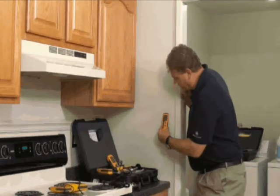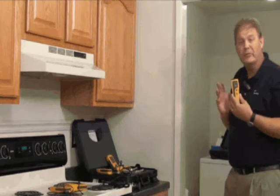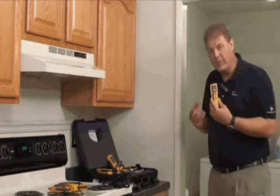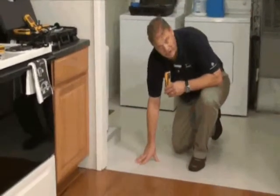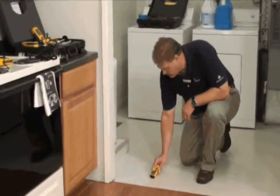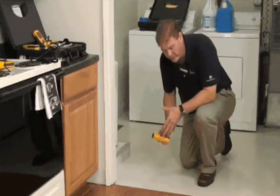This wall is nice and dry. Now one of the great things about using a non-invasive meter is you can use it to look for moisture below surfaces where you can't necessarily get to with something like a pin meter. So if we take a look at this vinyl floor, for instance, it doesn't look like there's any moisture on the surface here. We put the meter on here, and we can get an elevated reading. So it'll read below the surface.